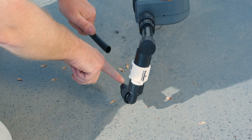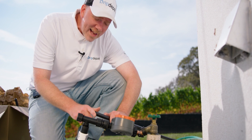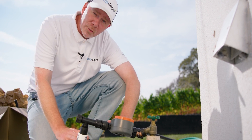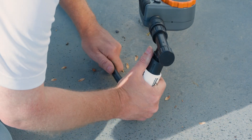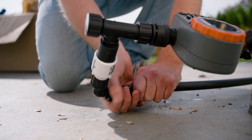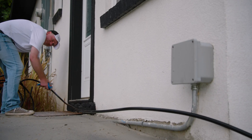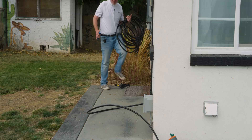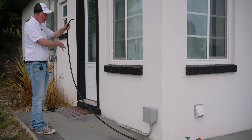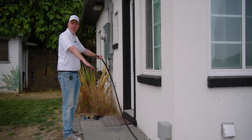To connect your tubing to your fitting, all you have to do is slide the fitting on over the barb and then turn the locking nut to secure it in place. If you're having any difficulty, dip the end of your tubing into a glass or pan of very hot water — this will soften the tubing up enough to make it easy to slip over the barb. We've cut enough mainline tubing to get from our head assembly to where the foundation starts needing watering. The tubing is flexible enough that it can take gentle turns without the use of an elbow. An elbow will be needed for sharper 90-degree turns, but for this gentle turn here, we're just going to let the tubing's natural flexibility take care of it.